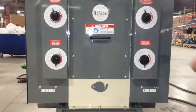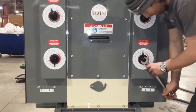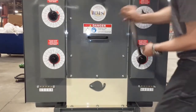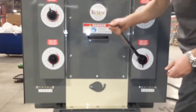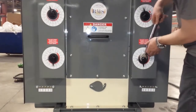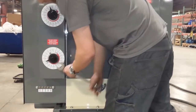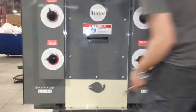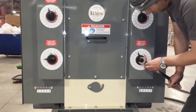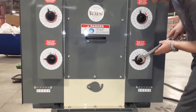Check your right side again — it starts to touch right at zero, so it'll go past 10 and he'll put it right at 10. Now that we know that the rolls are parallel, we'll start to walk the rolls in. We'll move them both into five. From there we'll check and see where the dial touches again — he touched about one, he'll go past five and move it back to five.